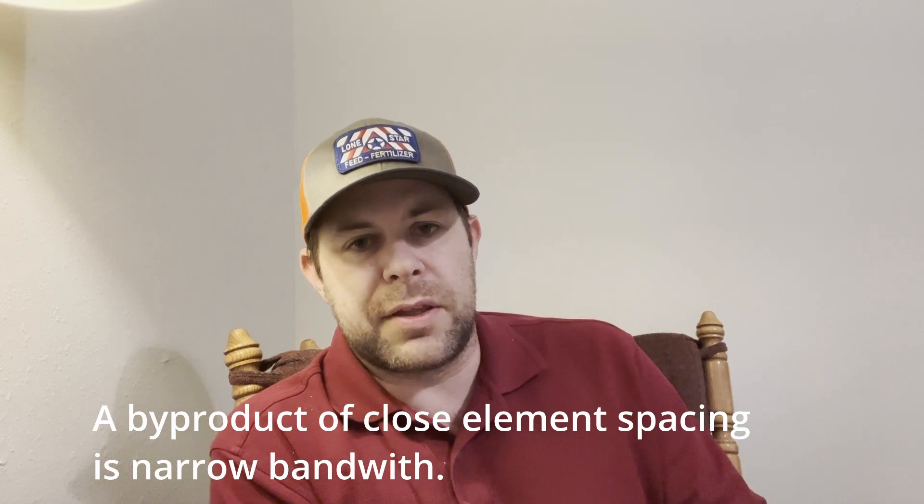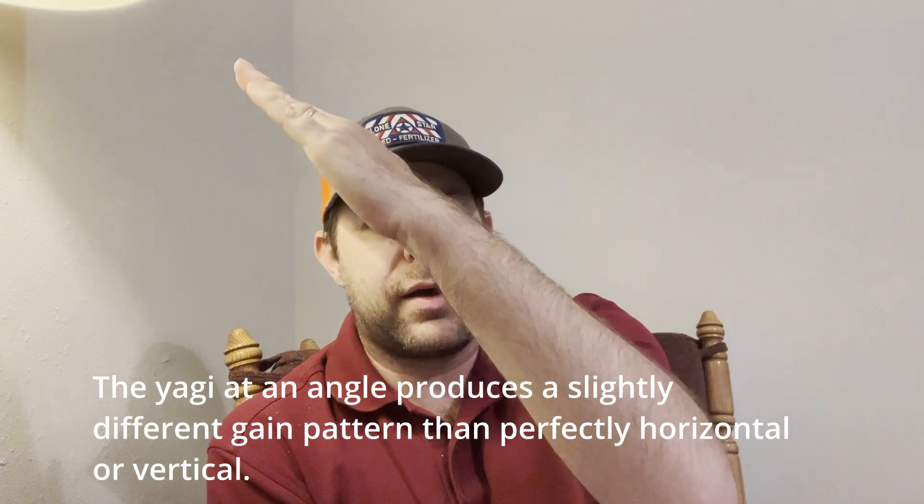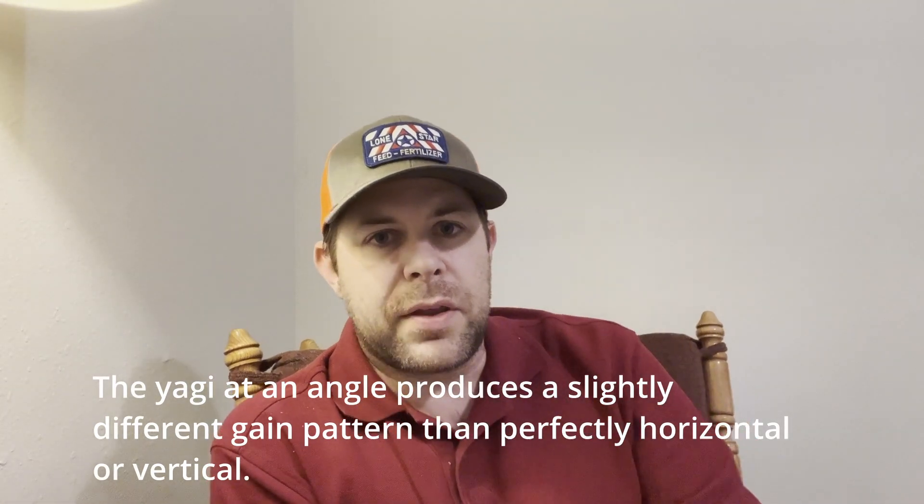I've got a few notes I'd like to share before we get too far into this. I've got two antennas I'm comparing. We are portable in a state park. I've got a delta loop that's about 125 feet long — the top of it's about 40 feet up in an oak tree, and it is broadside northeast and southwest. The two-element wire Yagi is cut for 20 meters. The elements are seven feet apart — it's about a tenth of a wavelength. It is sloping downward from a tree at about a 45-degree angle. The top of it is about 32 feet up, the bottom about seven feet off the ground, and the feed point is about 18 to 20 feet high. It is fed with a hairpin match and a one-to-one balun and 50-ohm line.